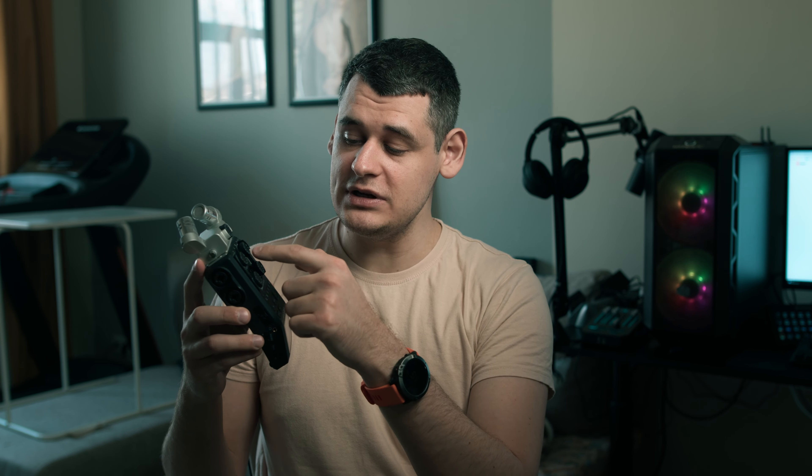So what is my option? My option is to set that gain really, really low for the quiet part and try to record the whisper with that low gain, and immediately we encounter numerous problems. The first one is you need to boost up the audio to be able to hear that whisper, and you're going to boost everything with it — the sound of the fan, passing-by cars. And it is not a big problem, but the biggest problem is that your sound is going to be noisy.